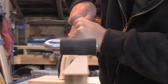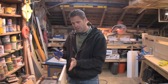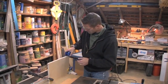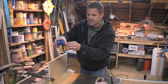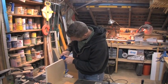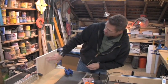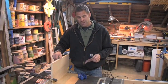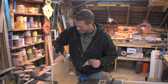Now comes the fun part. You can see it hangs a little bit on the side and a little bit on the front. This is a dual trimmer — it trims both sides of the veneer. The old way was to grab a block plane and just very lightly do that, but that takes time. So I just grab this little veneer trimmer, squeeze it, and run it right down, peeling off these little shavings. Normally two strokes will do it. Then grab a little sandpaper and just roll over the edges ever so slightly so it's not so sharp.